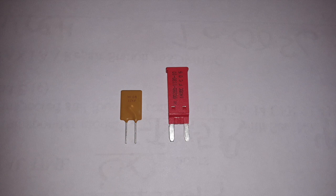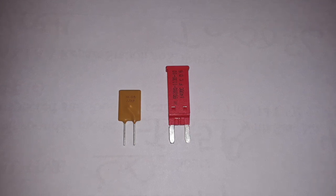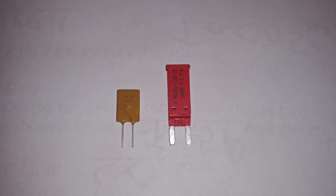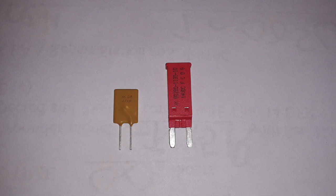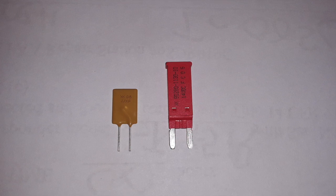While doing a search at DigiKey, I found another PTC that had nearly identical hold current and trip current as the first PTC, but with much greater capacity to dissipate heat. Pictured here is a comparison of the old PTC on the left with the new PTC on the right. Not only is the new one beefier, but it is also much easier to insert into the fuse holder due to the blade-shaped conductors. I have provided the DigiKey part number for that PTC in the description to this video.